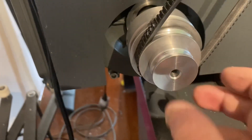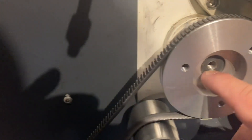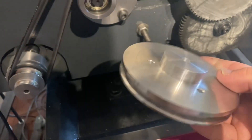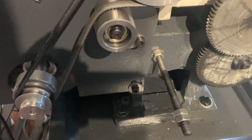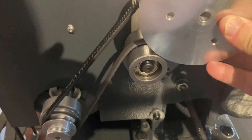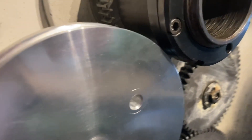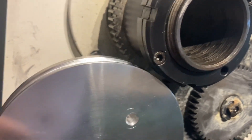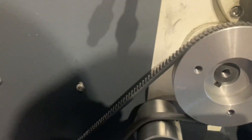Then I just put a bolt up in there to hold it together. Up on the other pulley it had a recess here, so I made another pulley — this one here — where that recess fits inside, which centralizes the pulley. I went to maximum size, the biggest I could, so that just sits up in there. As you can see, there's about a 3mm gap in between the pulley and the spindle. I drilled and tapped three holes into the original pulley to give it the strength.